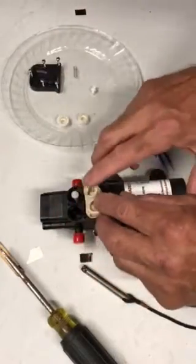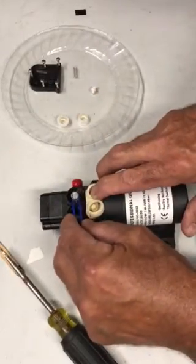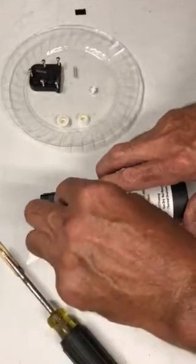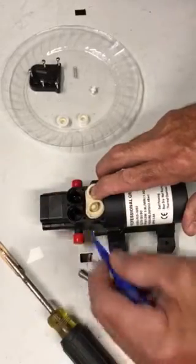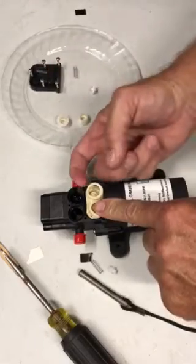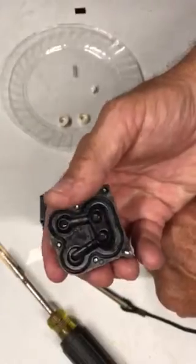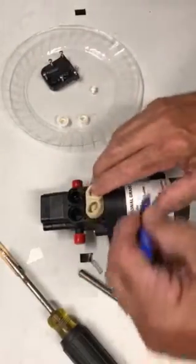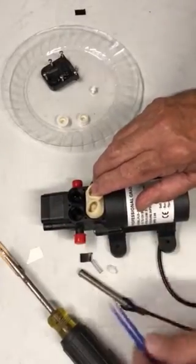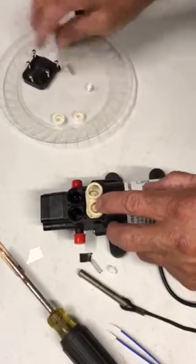This is where the photographs come in. You can see the opposite effect where we have this poppet facing the other way with the spring for this side of the pump. On the other side, there's that little black node sticking up, which is the exact same thing as what you have right here by my thumb. I've tucked this back and I'm cleaning it out with the tweezers — you're going to find something in there, and this is the main reason why the pump will not push or take prime.